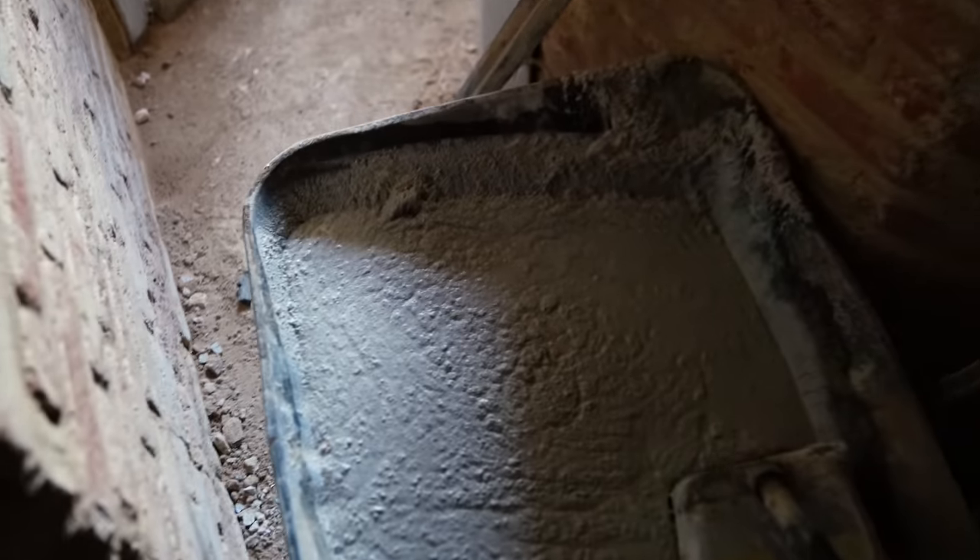The time has come — I'm starting the rendering with my machine. I'm going to get this stone wall done using my special spray plaster thing, which some of you may have seen before. It's basically a bucket with four jets and the compressor blasts the mortar on super quick and super efficient — it really gets stuck in there.